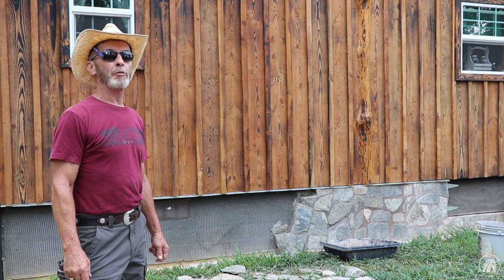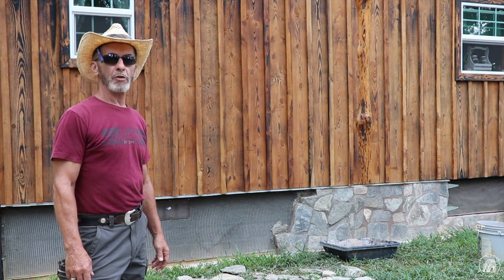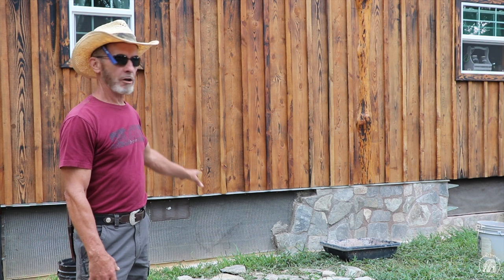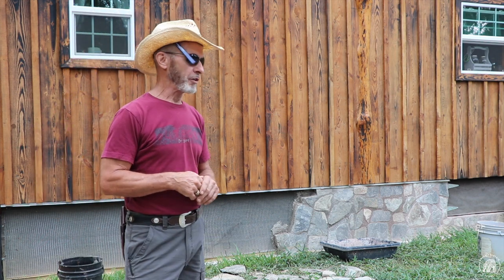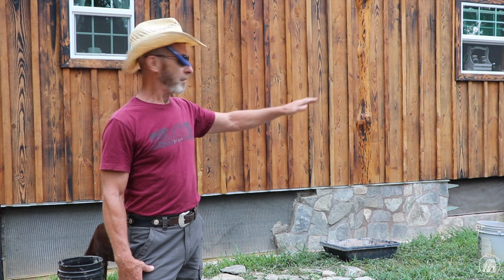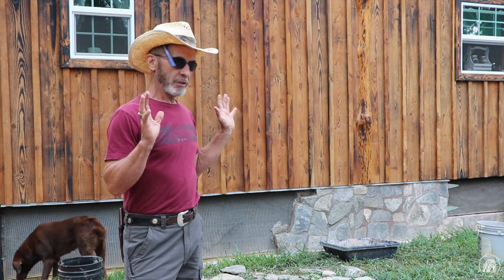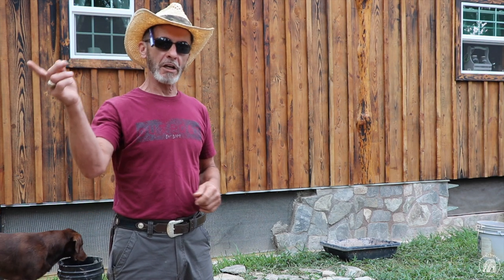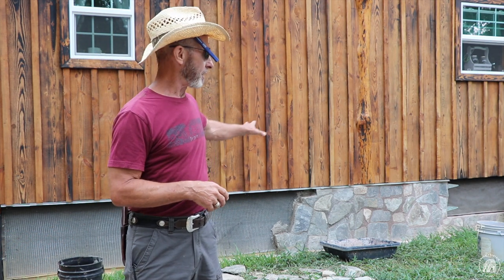Well, it's supposed to start raining here pretty soon, but it's only supposed to last a couple of hours, and then it's supposed to clear off this afternoon and we'll have a couple of days of sunshine. So I need to really try and get the rest of this side completely rocked, because I've got a phone call from the guy that operates the excavator, and he said he would come up here, we would pull all this rock out, take some of the topsoil that I've still got saved, and bank it away from the house, and that would take care of this side. It would be permanent then. He'll dig a ditch between the woodshed and the tiny house. That will take care of any water that may come off that way. And now that I've got this slope going behind the cabin, anything that comes down off the bank will run that way. But I still have to build a retaining wall to keep all of that shale and stuff at bay so that it doesn't fill up that ditch. So that's what I'm going to be working on in the next video, because I've got to get this done in the next couple of days.